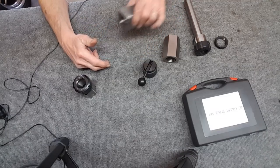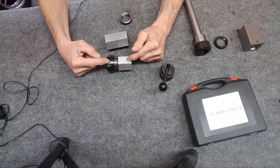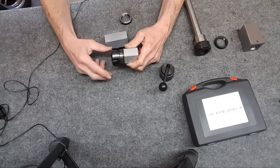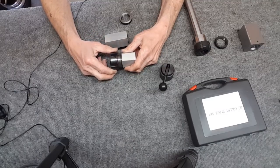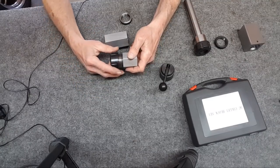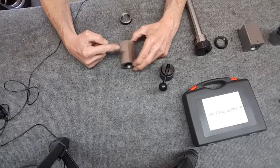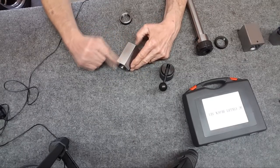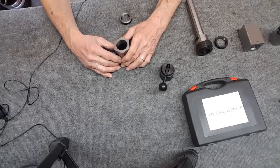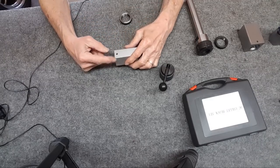The reason I really wanted to get this is because every time I try to use the spin indexer to make a hex head it's always off - something's wrong with that unit. I cut here and then cut the next flat and it's cutting deeper, so it's off, and I'm always playing with the Z-axis. On the granite surface this new block is perfect - exactly the same height, no movement within a tenth of a thousandth. The set screw worked fine on this one. On the other one, when they cut the slot for a spade screwdriver, they mushroomed things out.